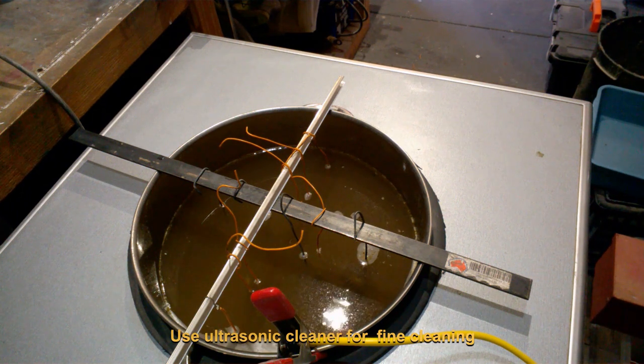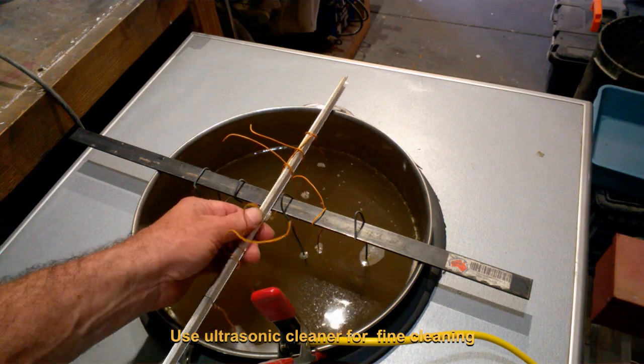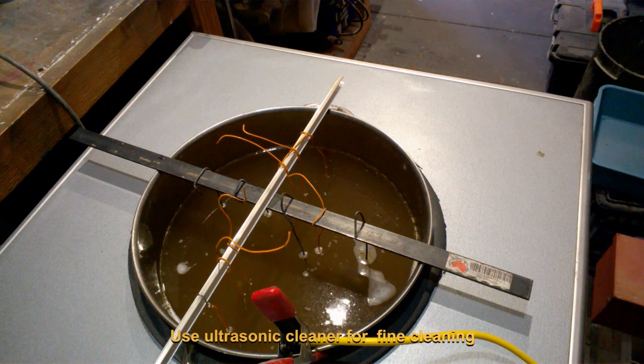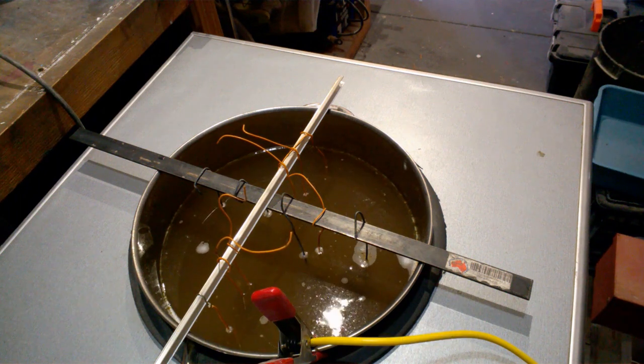We're going to use the ultrasonic cleaner to remove any residual traces of contaminants, and in particular, because we will be applying a painted finish to many of the drill components, any remaining grease that may be clinging on to the component pieces. Because we will also be employing mechanical abrasive techniques, we do not want to clog the abrasive medium with any unnecessary flotsam and jetsam.